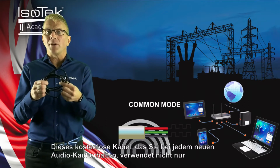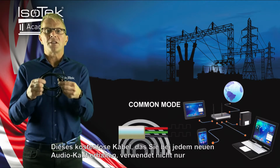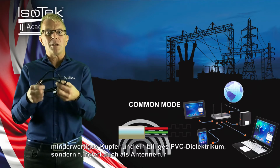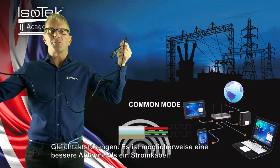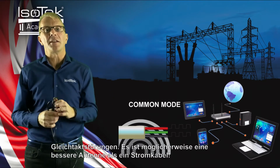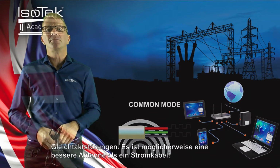This cheap cable you are given with any new audio purchase is not only using low-grade copper and cheap PVC dielectric, but it also acts as an antenna for common mode noise. It's perhaps a better antenna than it is a power cable.